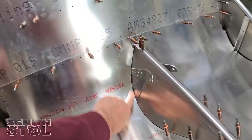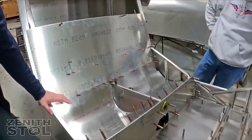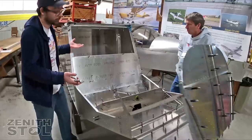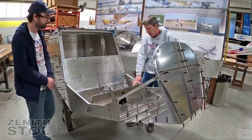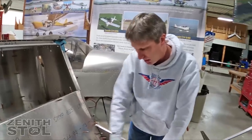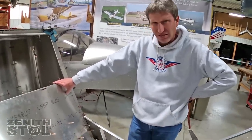The beauty with everything already being pre-cut really shows in the workmanship — it would reflect well on the finished product. Originally you had to cut out the skin, so fit depended a lot on how well it was measured. Now it's done for you. In the original 701 we supplied a square piece for the seat bottom and showed in the photo manual how to take a cardboard template, figure out each side, tape them together, lay it on your aluminum and trim them out. It's all very doable stuff but it's time consuming, and workmanship would vary from individual to individual.